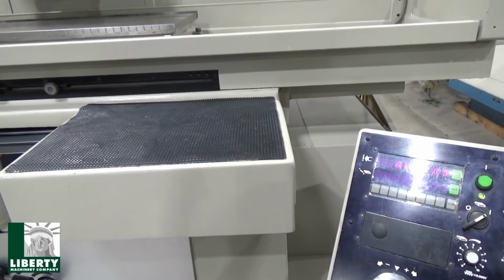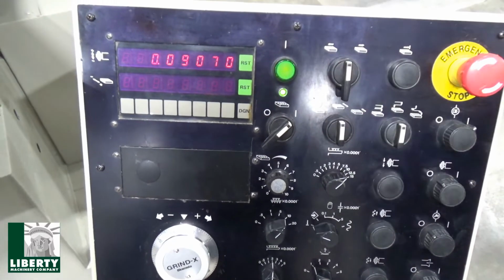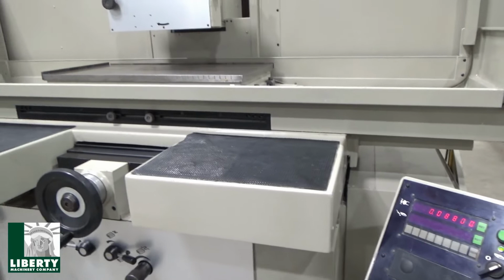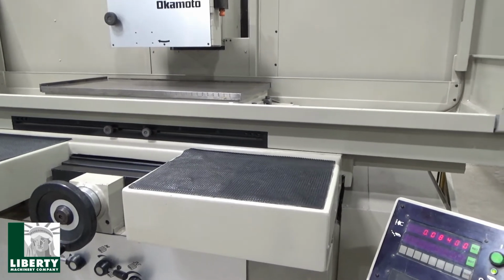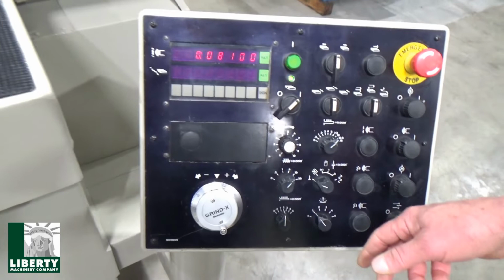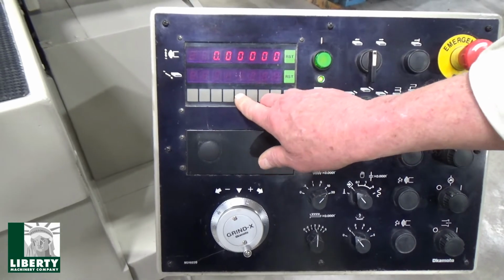It's dropping. Or I can go both sides. I'm just going to switch it over on the fly. And every hit of the table now, you see it dropping down. I'm just coming in on it. So that's a tenth there, 10/10 is there. I'm on course. Let me back up and do traverse grind for a second, reset, and do 10,000ths again.